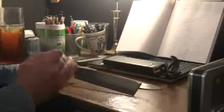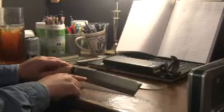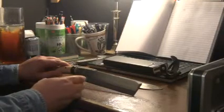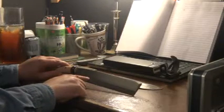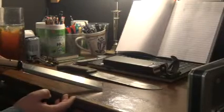So when I talked about the Junglas, I said it was 20 degrees per side on the Junglas, so 40 degrees total. The edge angle right here on this blade, and this is called a garden machete from a Japanese woodworker, but it's called many different names, the edge angle right here is 15 degrees total. Not 15 per side, there's a 15 degree bevel right here. It transitions then into a convex bevel right here, which sweeps down to the edge.